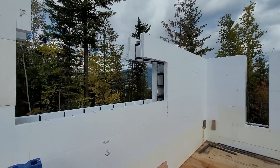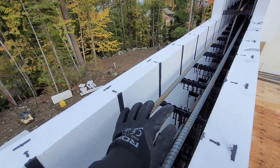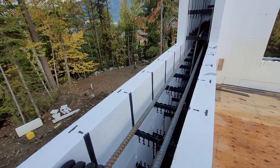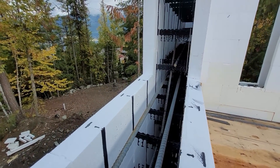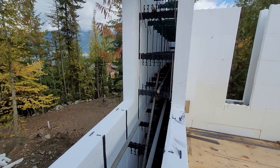I'll show you in this one. In addition to the regular rebar, each window gets two extra lintels along about two inches from the bottom. And then they also get a little diagonal bar on the bottom corners and the top.